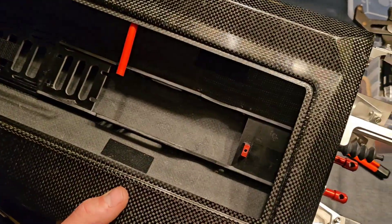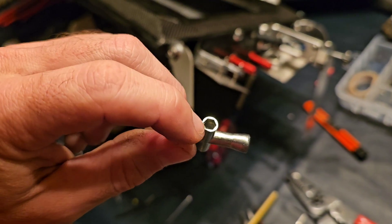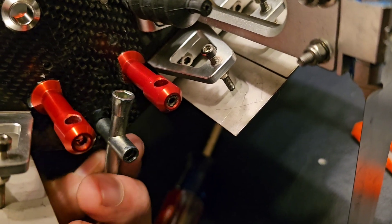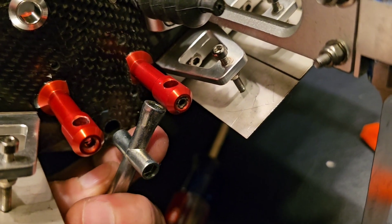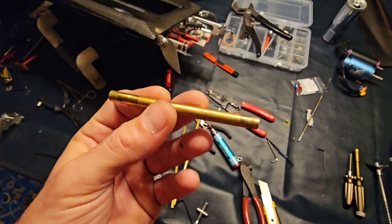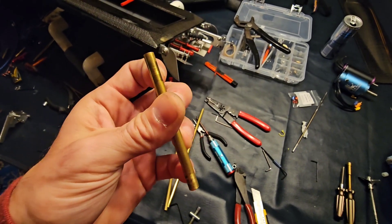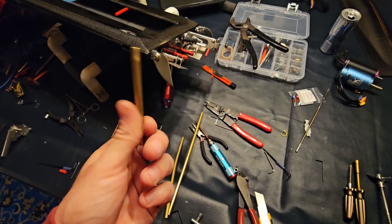With a little bit of success, I was able to get the rear stuffing tube out of the back. All I did — which is kind of crazy — I took the end of this and set it up against the brass tube. I just tap, tap, tapped it with a hammer on this end because the stuffing tube stuck out about yay far on a flat surface, so I didn't have to worry about ruining it. I just drove it right on through and it fell right out. Here is the original stuffing tube, all of about four and a half, five inches long. It does not have any bend in it whatsoever — roll it across the floor, perfectly straight.